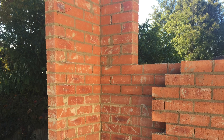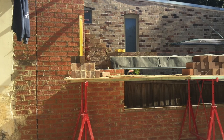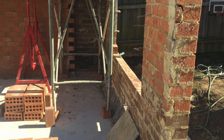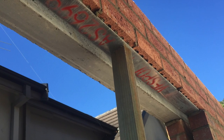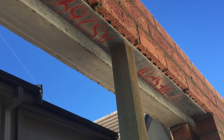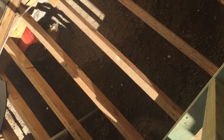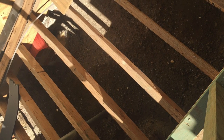And then with the brickwork, what are you doing there? So it's double brick. And then I was going to ask, what are the vents on the outside? They're just washouts. So when we hose our cavities out, the water and slurry can all go out at the end. Cross ventilation, but on the western side we can't get any cross ventilation, so we're getting an automated ventilator down underneath the dining room just to keep the air coming through.